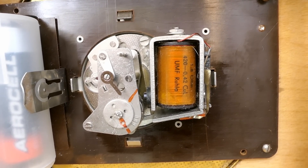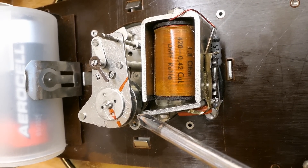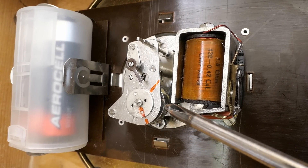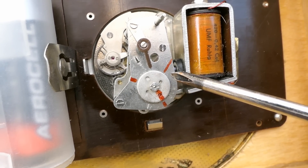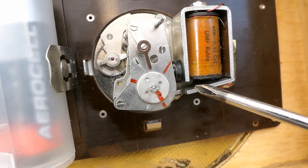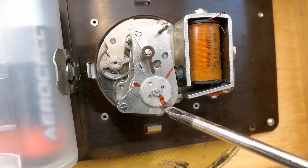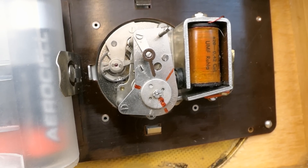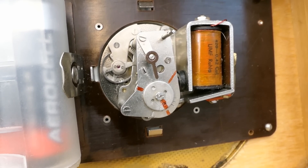The electromagnet now operates with a wider gap, probably meaning it's one revolution less tight than before. The electromagnet pushes the contact about 4mm and then it travels by its momentum about another 6mm. I found the loosest position of the spring which still makes it run, and the tightest position where the electromagnet can still pull with this wide a gap — I'm basically in the middle of the interval where it works. I really think somebody just overtightened it trying to desperately solve some problem — maybe some solidified grease. I cleaned it using a brake cleaner which is a horrible solution probably, but anyway it seems to work now.